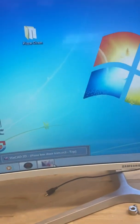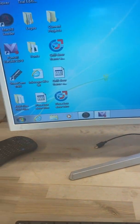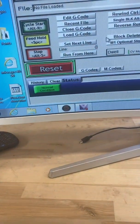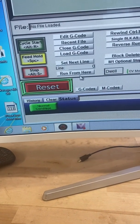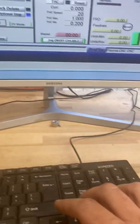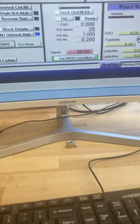I figured for the Premier Plasma guys I'd make a super short easy startup video for the absolute beginner. Once you have everything up and running and you're going to Mach 3, one of the things you'll see is this thing will be flashing down here — you've got to reset that and make it green in order to be able to move your torch around. At that point, if your torch is wired up, you should be able to jog it around with your arrow keys: up, down, left, right, torch up, torch down — super simple stuff.